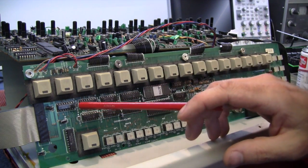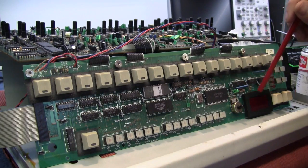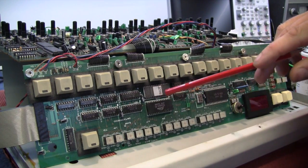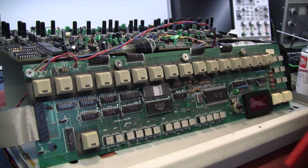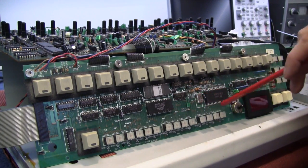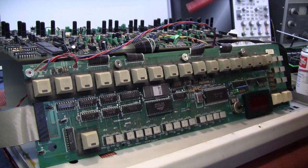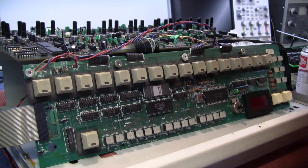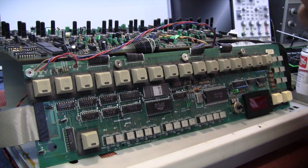Just a quick look across this board: you've got all your little flip-flops and things, a 12 MHz crystal, and a nice display. This is your EEPROM — as I said earlier in the video, there are four versions. You can buy an updated EEPROM and swap it out, though it's a bit of a pain. Your main processor sets your drum rhythms. The three ROMs we saw on the top are actually for the ride, the crash and the hi-hat — they just hold the information for those six-bit samples.